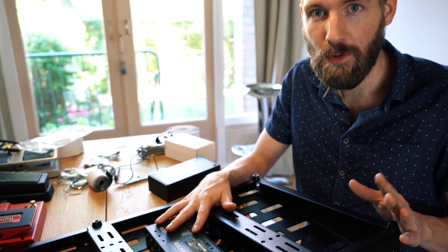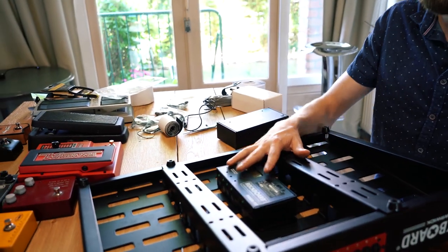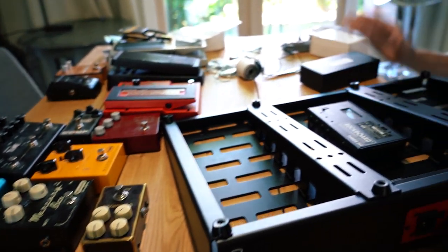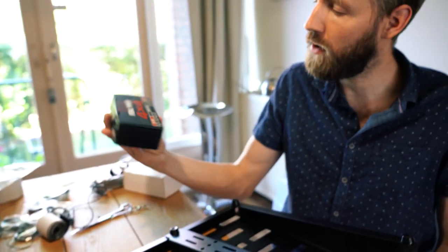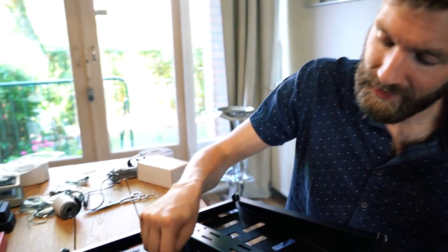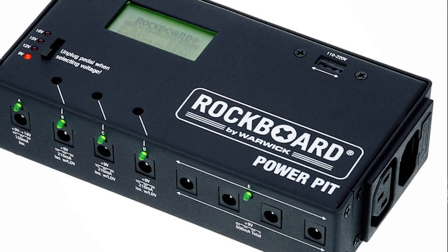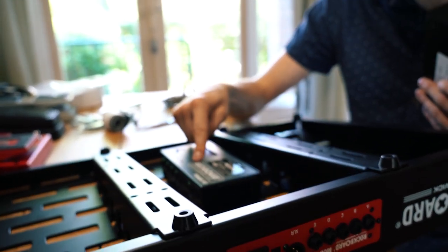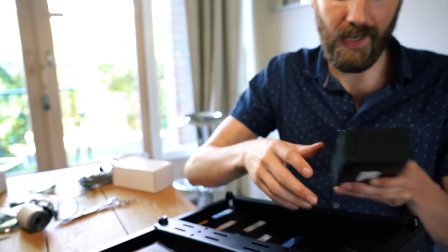New plan. The Power Pit by Rockboard doesn't support 300mA, which the Strymon Mobius and the Timeline need. So in conjunction with the Power Pit, I'm gonna use the Pedal Power 4x4. One big bonus about the Power Pit is that it can pass current through, so I'm gonna use this input, route power through the Power Pit, and then with another cable to the other unit. So I only need one power cable, which is a good thing.